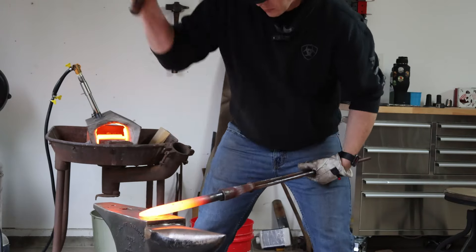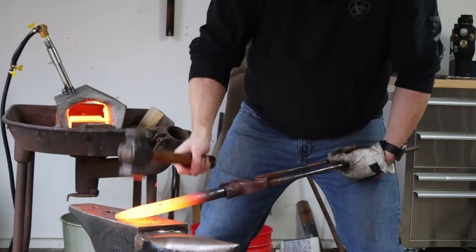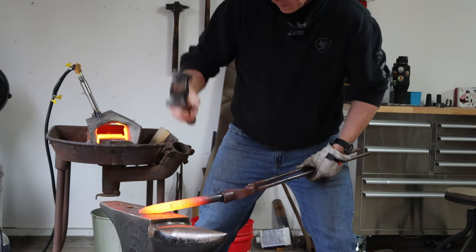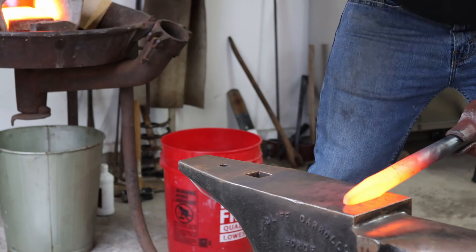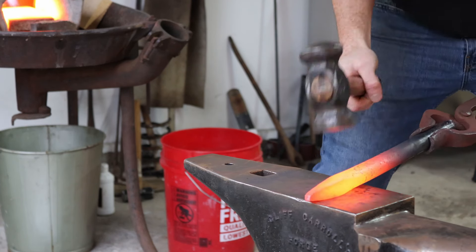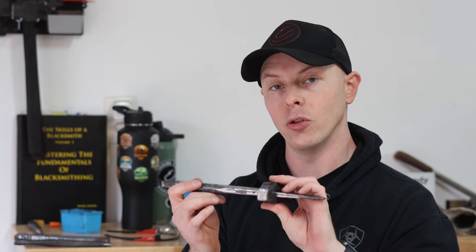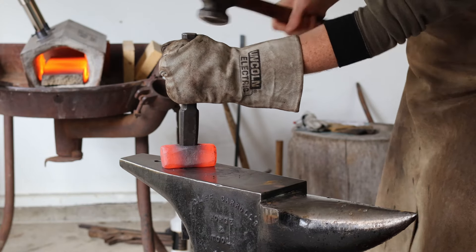Punches are also heat-treated and hardened so that the tip doesn't deform a whole lot when you are hammering the punch into the piece that you're punching through. But what you don't want to do is leave the tip of that punch inside the hot steel for very long because you will soften the tip of the punch and potentially mushroom that over or get it stuck inside the piece. And while you can still heat treat and re-temper the punch to re-harden it and make it a more serviceable tool again, you generally prefer to keep it hard and usable time and time again. So in order to make the hole the size that you want it to be, you use an intermediary tool called a drift — a tapered piece of steel that you drive through that hole to widen and spread it.